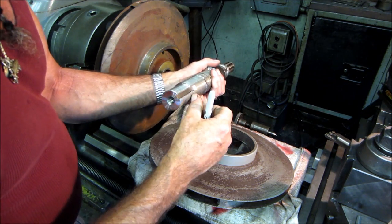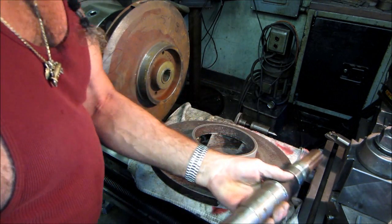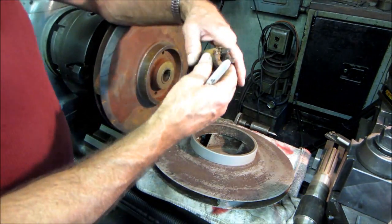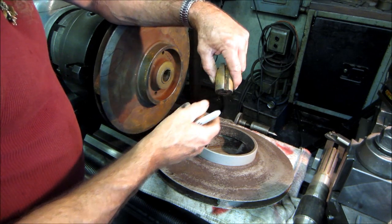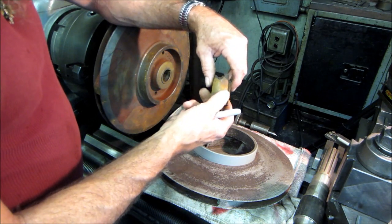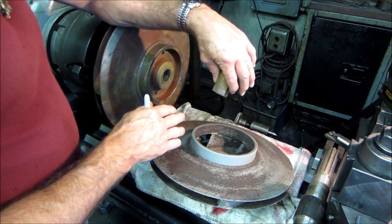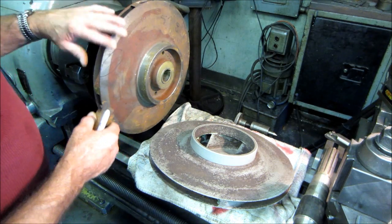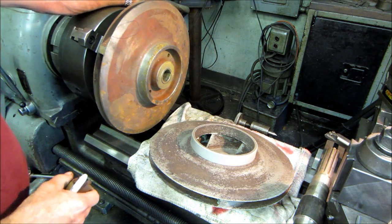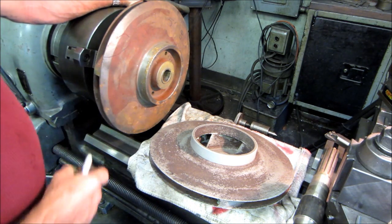Once that little tiny pressured area gives way, the impeller starts walking, and if you have rust and corrosion, it causes it to fatigue and fail prematurely. And prematurely means anything less than the max so far. The one he's got in service right now is going past a year. This one lasted just slightly past a year. We don't know how this got broken, whether it got broken shipping or thrown around in the back of his truck by a crew member or whatever, but I do know that we need to pay attention to that.